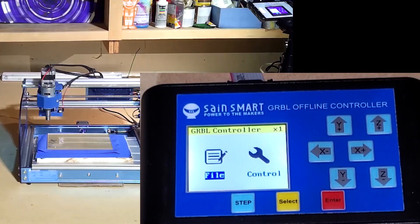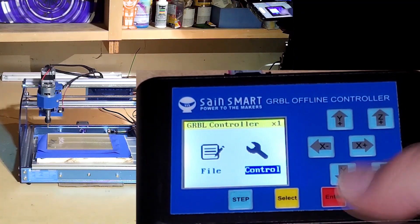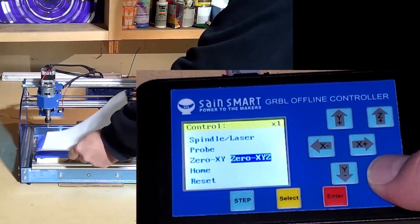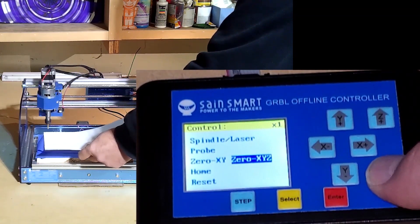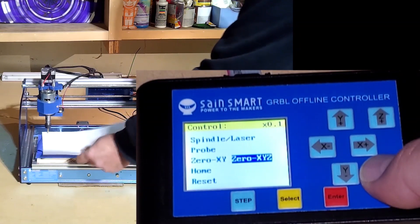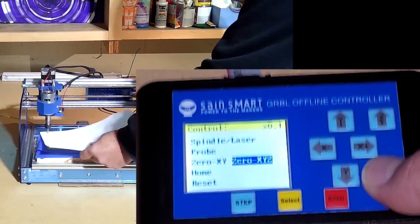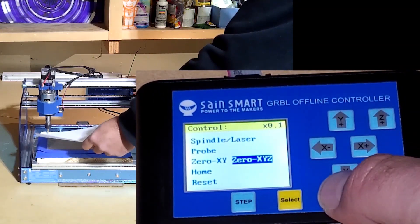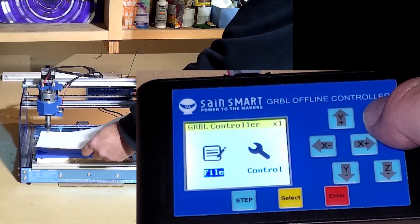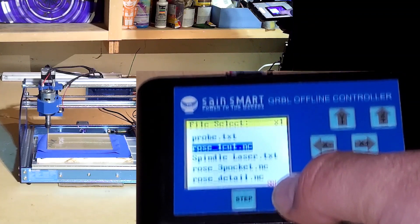So then we raise it, take off the drag bit, and put on the three millimeter end mill. Again, we're going back to zero XYZ and we'll lower it down until it catches on the paper. Once it catches, I moved it over to 0.1 millimeter and went down just a couple so it is totally flat. Hit enter, then long press enter to get out of it again, jog the Z up two for the retract height, and we'll go find the pocket and run that.